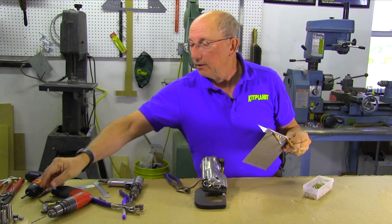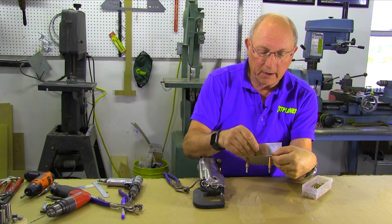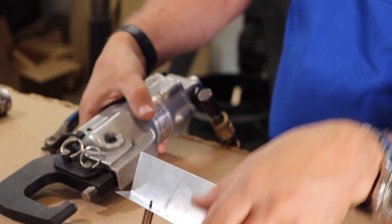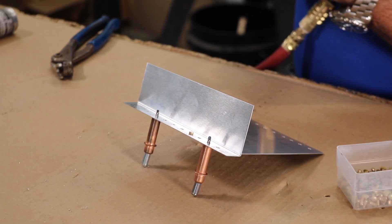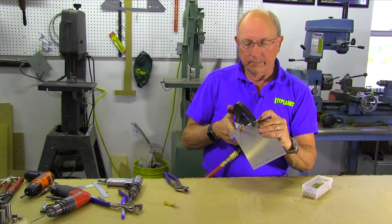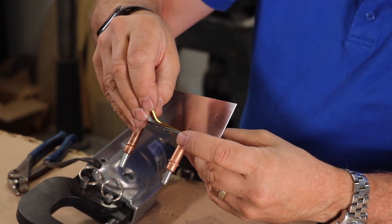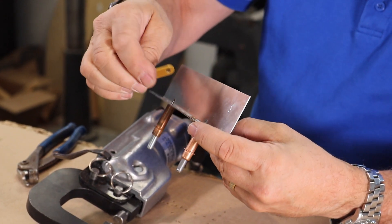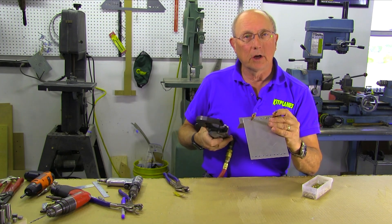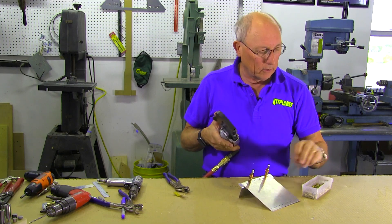And that's all there is to it. Now we're going to take our little tool and see if we've squeezed it enough. Since this hole goes over the tail of the rivet, it hasn't been squeezed quite enough, so we're going to give this about a half a turn on the adjuster and then squeeze it a little more. Now it doesn't go through, so we've got the right setting. Since we're doing a line of rivets, that first one was to make sure we had it set properly, and now we can do the rest of our rivets.